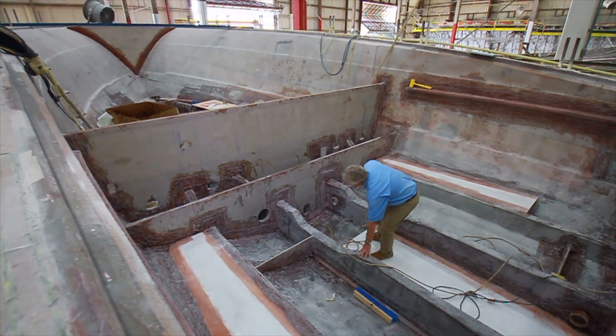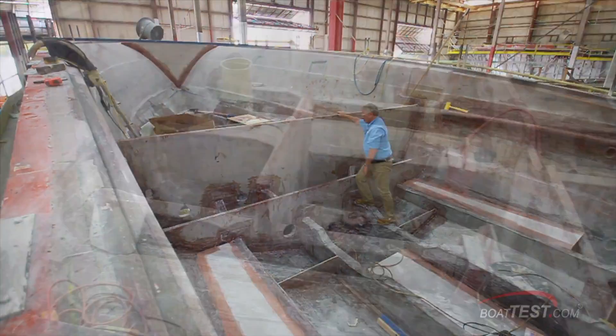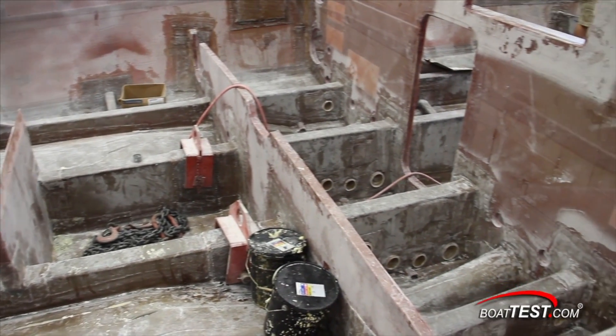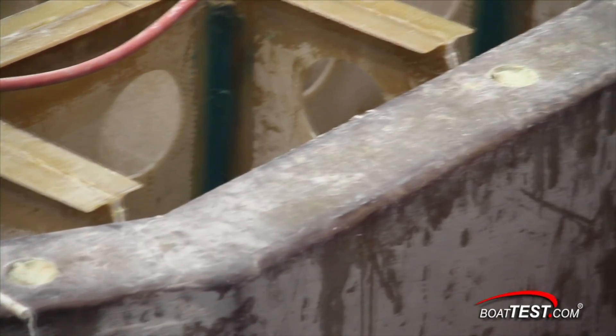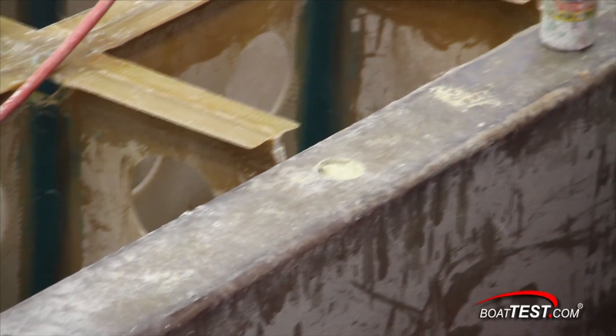As you can see, there are four huge longitudinal stringers stretching from bow to stern. They transfer the stiffening of the bulkheads from an egg-crate shape structure into the bottom, which gives the hull immense strength. An interesting design feature about the GT-series is that the fuel tank is completely integrated into the hull between the stringers.